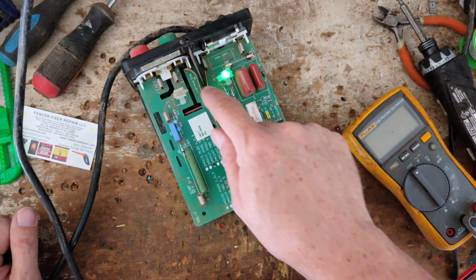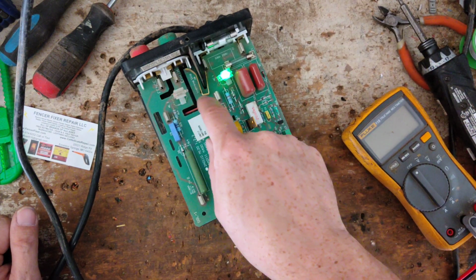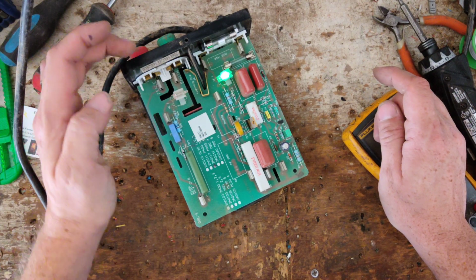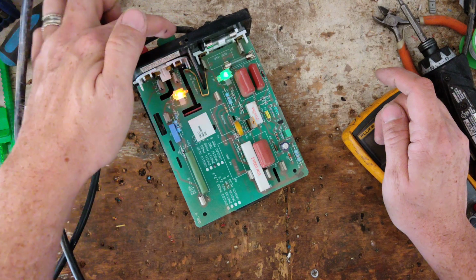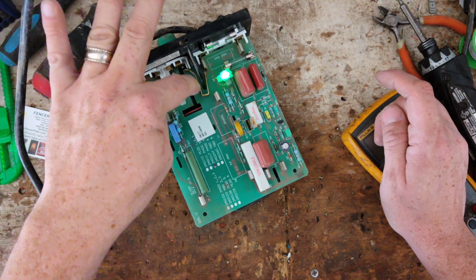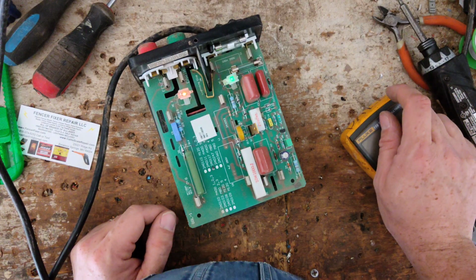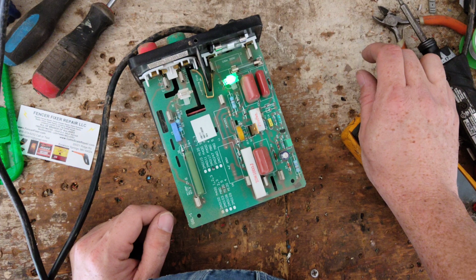It's pretty slick. They even got a little lightning spark gap diverter right here. That little brass strip that runs across here over to there. It kind of acts as, so if lightning comes in on the fence side, it arcs across that little gap right there, which is the ground over to the ground side, and then if that fails, it arcs from there over this lightning rod, which goes over to the neutral side. Yeah, the neutral side of the AC. That's the way it's supposed to work. So they do a pretty good job.